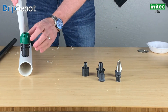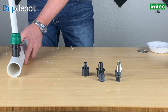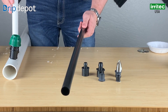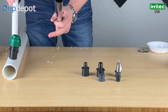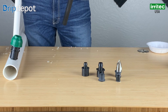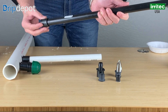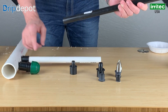Now we're going to go over our speed riser connecto fitting — it's a very popular way of doing this. Our tubing is a speed riser. It is specific in outside diameter to the connecto fitting. It is not IPS, meaning this is not the same outside diameter as standard pipe. So it will never work in other applications — they do not fit, they're not the same. It's not three-quarter inch pipe; this is specifically made for this.